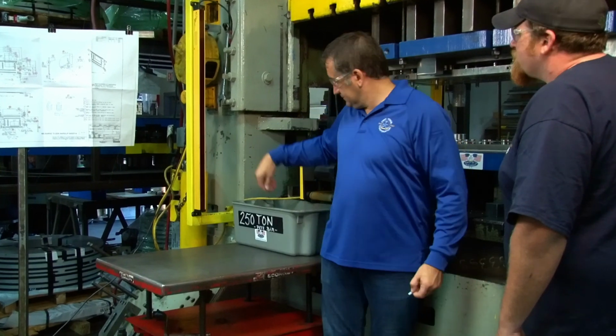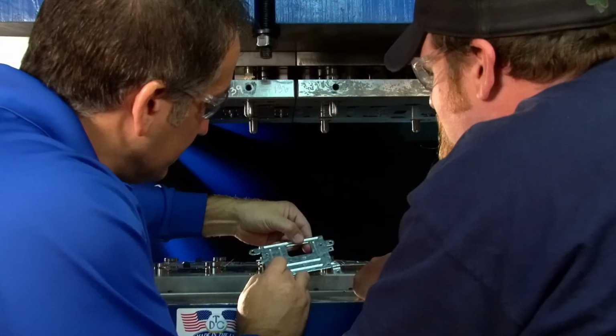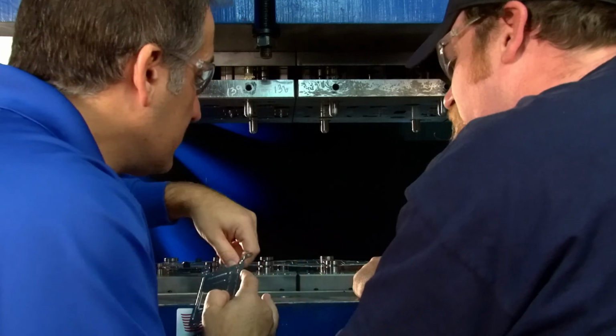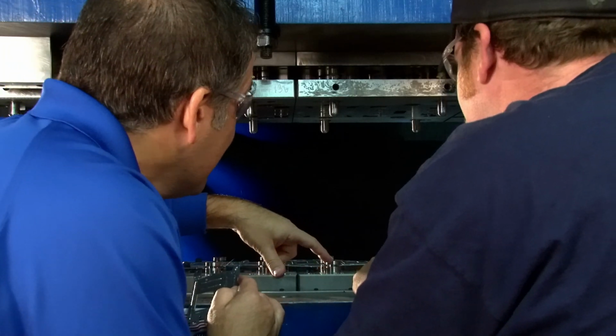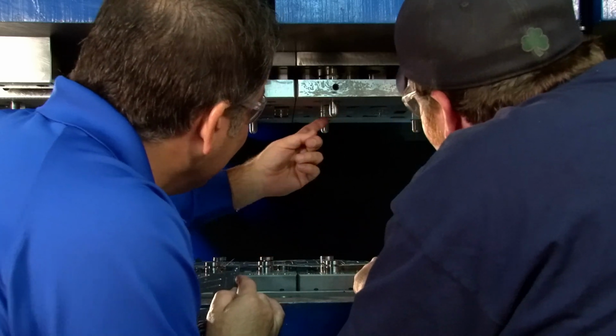During the stamping process, slugs can begin to pull at any stage of the run. Even after a few hundred successful pieces, slugs can begin to cause problems, despite your best efforts to stop them. Whether or not the punch has an ejector pin, the opening is carburized, or if you rooftop it. Fortunately, there's now a simple way to avoid these costly setbacks.